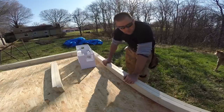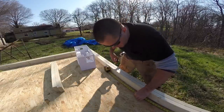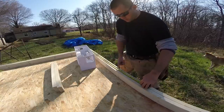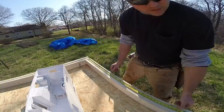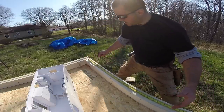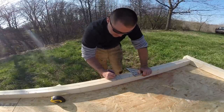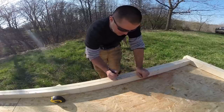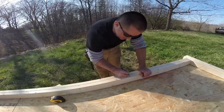This end wall is going to have a roughly four foot by four foot window. Since I have a closet going in this corner, I first measure out from my reference line — three foot, three foot three and a half — and transfer those marks to the top plate as well. From the inside of the wall to that mark I have fifty-one and three quarters inches, so half of that is twenty-five and seven eighths — I'll put a center mark there. It turns out I'm not going to be able to fit a four-foot window in that opening, so I'll just put a stud, jack, stud, jack arrangement and make a window that fits. On the closet wall side I'll put a stud and a jack, and I'll mark it an inch and a half — this will end up being a two-by-six backing to create an L and give me backing on the inside of the closet.